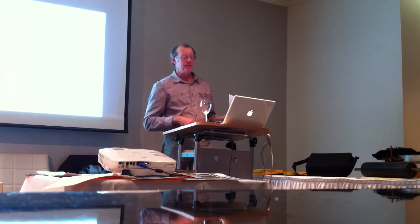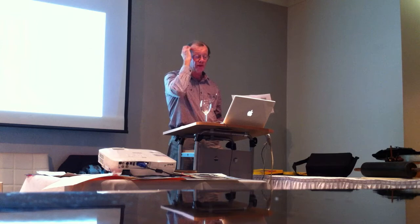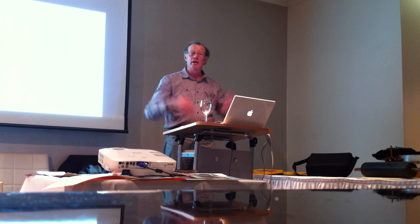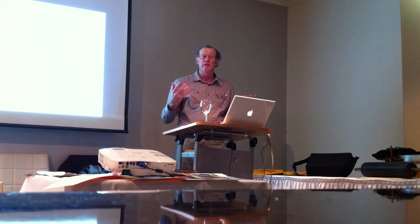As I said, etching, as a process engraver, we use acid, a nitric acid solution, to etch the image. It's done by running it through an acid bath, and as the acid eats into the image, it also undercuts the image. If you just left it in the bath, the image would eat down and undercut, and eventually the enamel would come off and you'd end up with just some humps there. You'd lose your printable image.